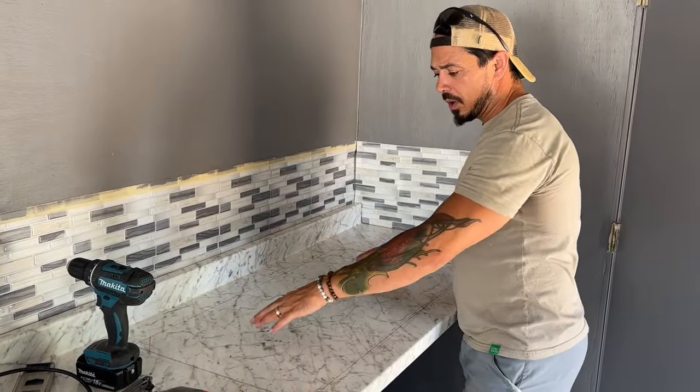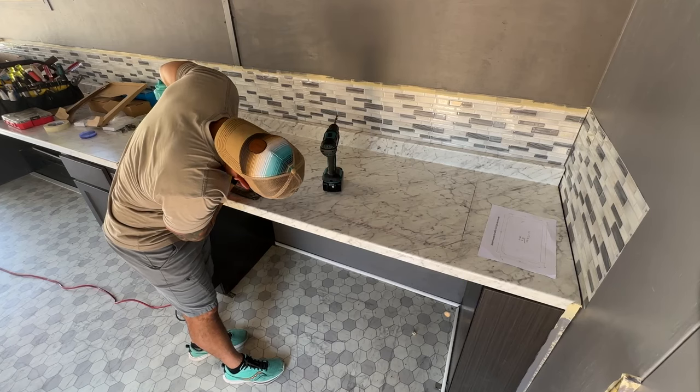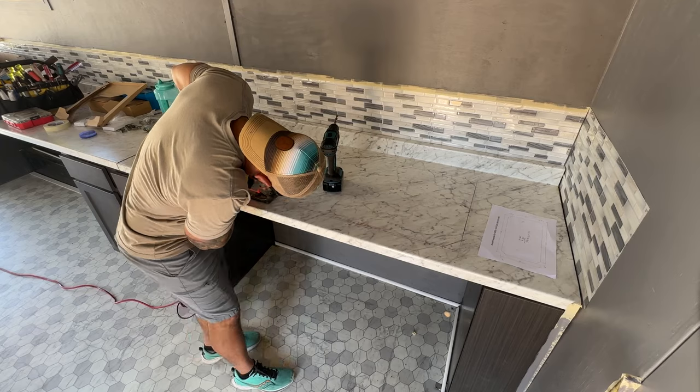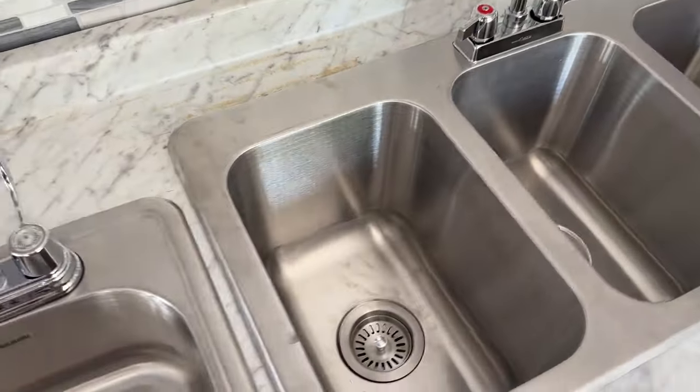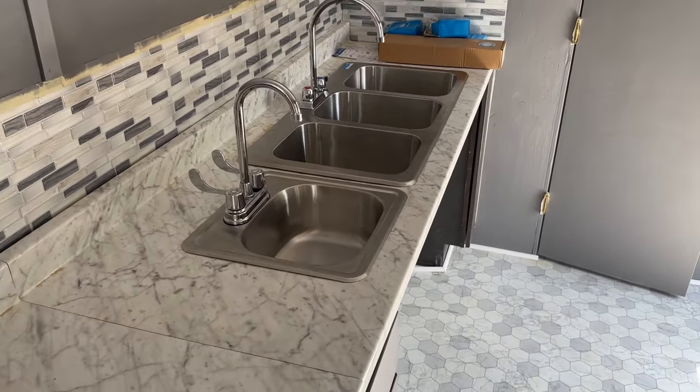When picking where to put your sinks on the countertop, if you're going to have drain boards — and most of the time you're mandated to have them — you want to be at least 12 inches from any wall so your triple sinks have space. Also check your code and regulations, because California is notorious for requiring integrated drain boards where the drain boards and sink are all one piece of metal. On the y-axis, the further away from the wall, the more room you'll have to work underneath the sink and attach plumbing fittings — but be mindful of splash.